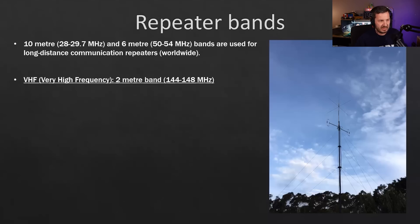The most common band is VHF on two meters — two-meter repeaters are everywhere, probably because it's the best performing band for what it is. Two meters offers good range and is not as noisy as 10 and six meters. Those repeaters are suitable for urban, suburban, and rural areas, making two meters almost a perfect repeater band.